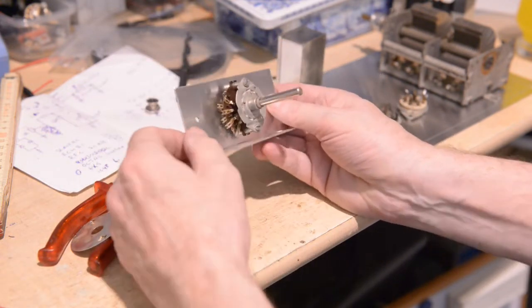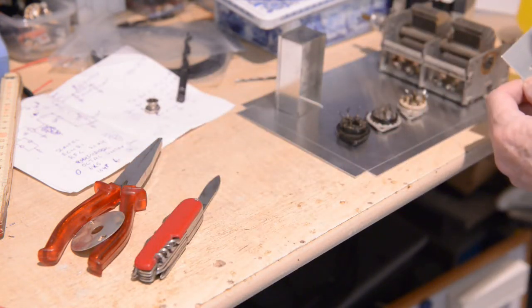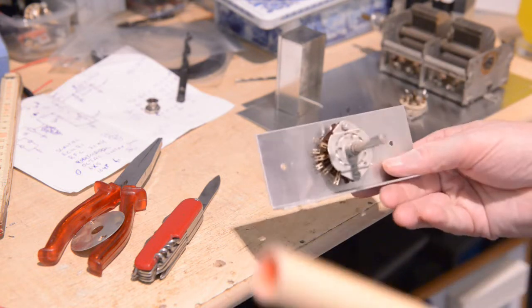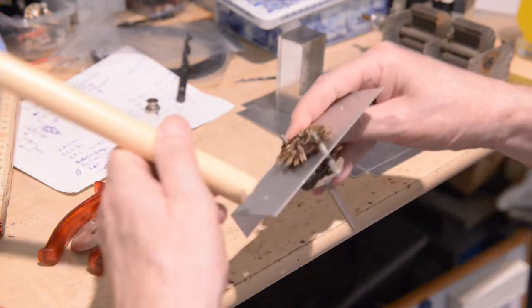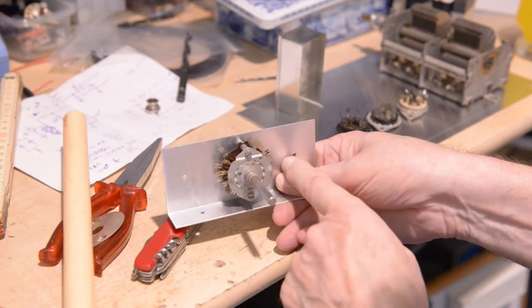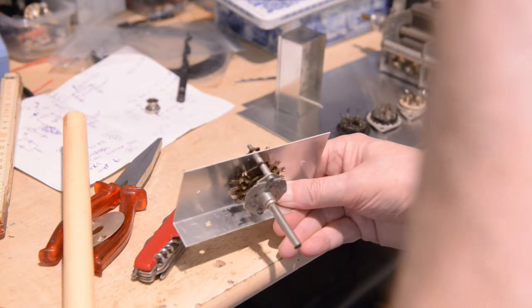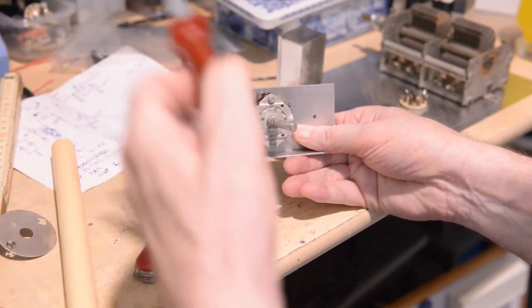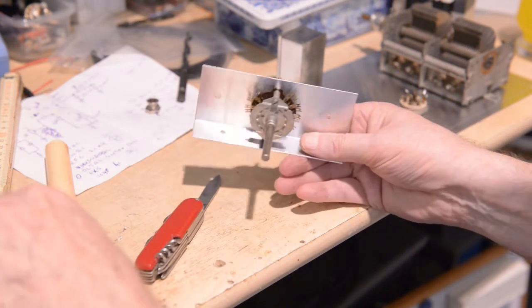Where's my pipe? There we go. Well, actually that would be 15 millimeters and this is 90 millimeters. So we have to put it on there on both sides. There you go. That side and that side. So this will be the reception coil on this side, and that side will be the oscillator, all right? So there's a three-way switch, which gives you the advantage of putting it in the middle and it won't do anything.